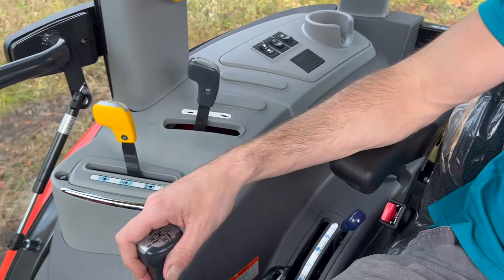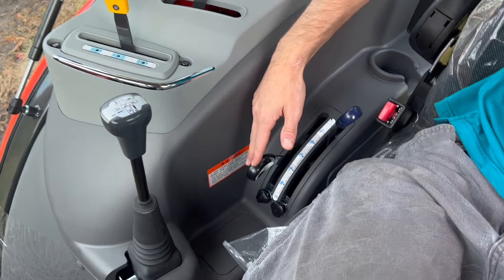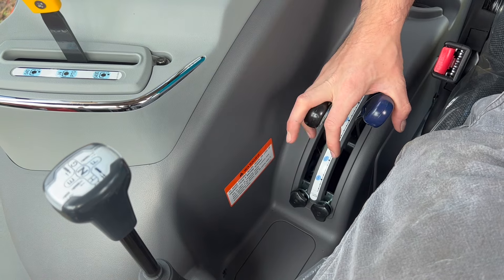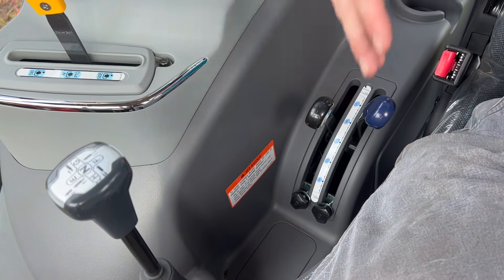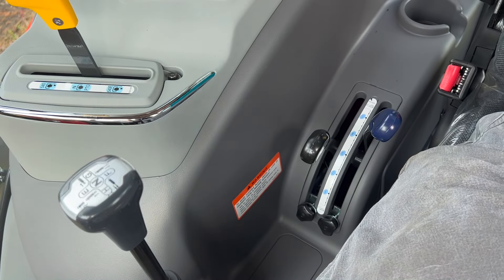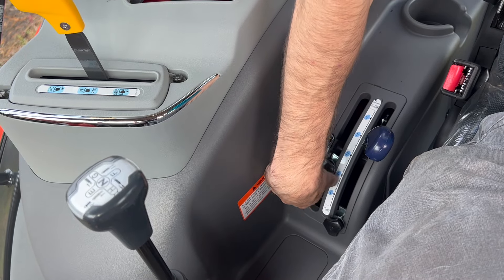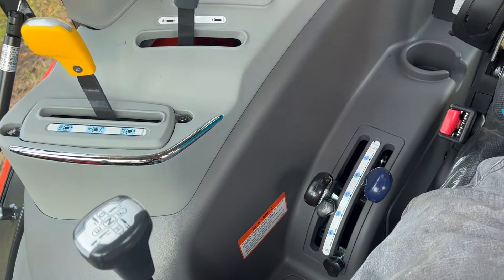One thing I didn't mention — this armrest comes right out to the loader joystick, very comfortable and in a perfect position. Back here, we have your draft control and three-point hitch control. In a bigger ag tractor like this you'll usually get draft control on the three-point hitch — it's really only going to be used to not allow an implement to hop out of the dirt. So with a disc harrow or a two-bottom plow, when it drops in and hits harder soil, the draft control allows it to only fluctuate in a certain area. It also has lockers so you can lock it and your implement doesn't sag over time, and you always lift and lower to the same exact height setting.